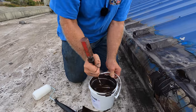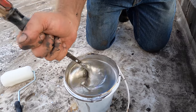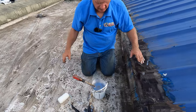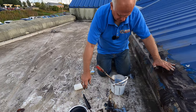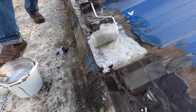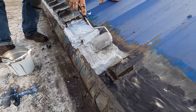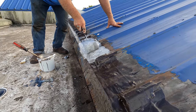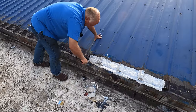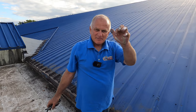It's aluminum asphalt — that's what silver coating is. It takes a while to mix, but you can see it gets thicker and the aluminum is getting mixed in. All you do now for this final step is take this and roll it on — and you're done. This will protect it against ultraviolet and the sun. That is an important step to make this last. If you don't, the heat and ultraviolet will destroy everything. Silver coating — that's the final step. Thank you for watching, see you next time.